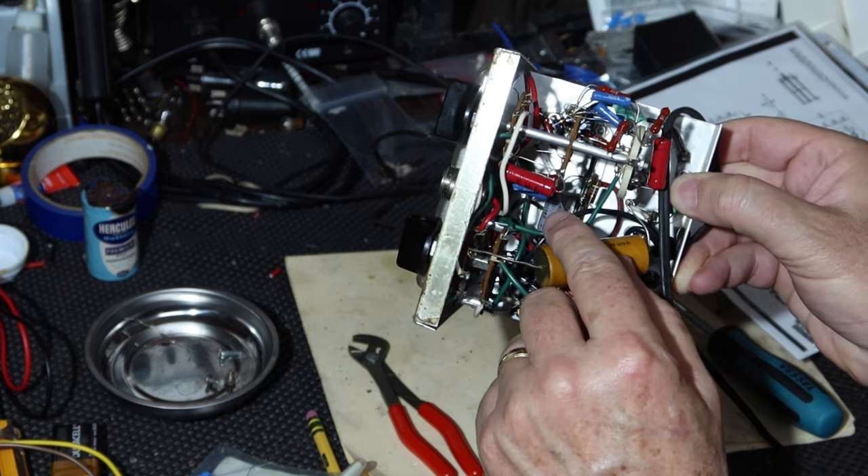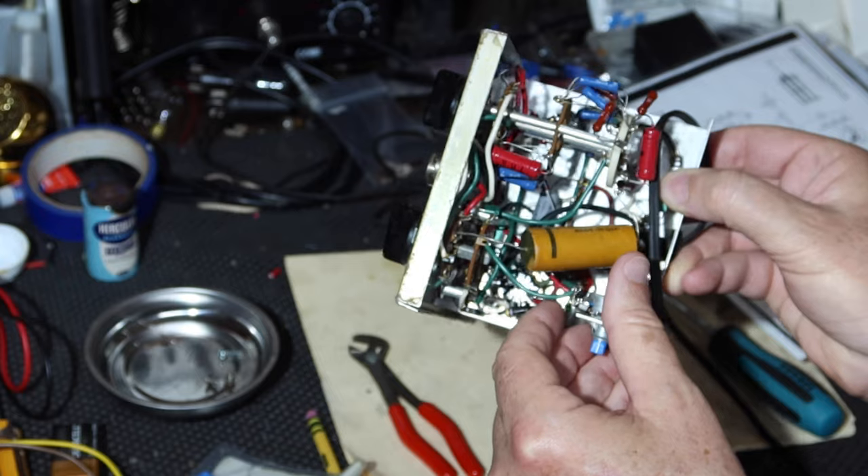The other one with the bulging end is C5, which is across the output of the secondary of the power transformer — I'd like to get that one working. It is a 10 microfarad at 150V electrolytic, and I happen to have a 10 microfarad at 250V on hand, actually two of them. I'm going to sneak those in there before I power this thing up to get some control on the ripple.